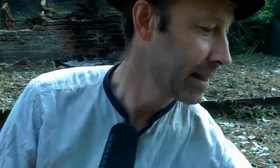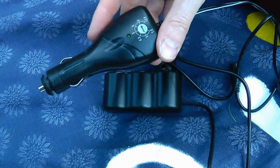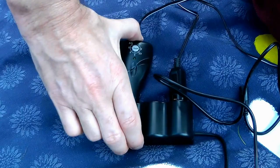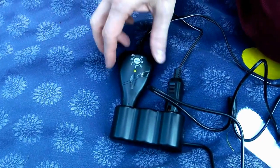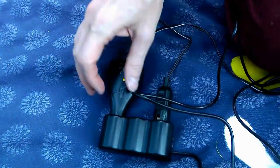Next is a small 12-watt, 12-volt adapter. It takes 12 volts and converts it into 1.5 to 9 volts. You simply plug it in — the light comes on, it's now putting out 9 volts — and you can switch it into other voltages. This will power or charge small electrical devices; you just put a different adapter on the end.